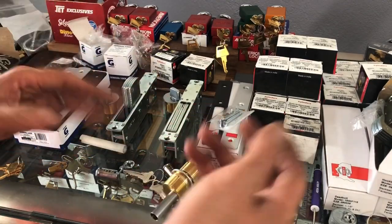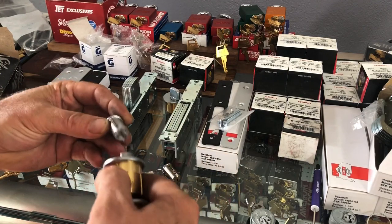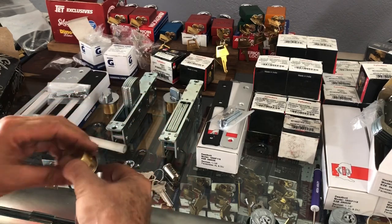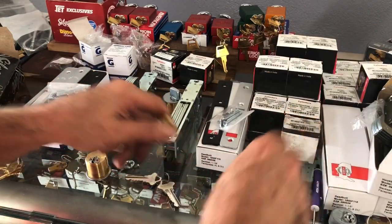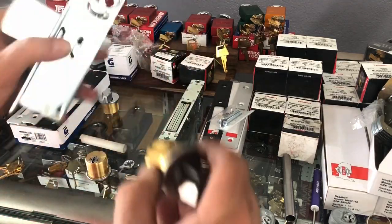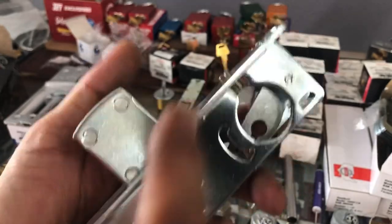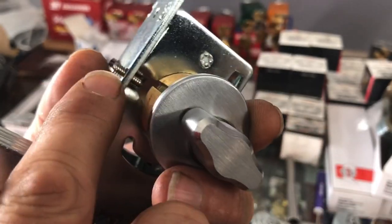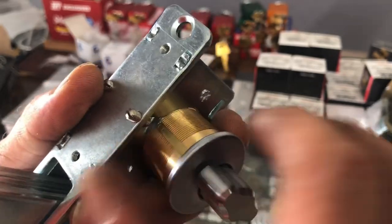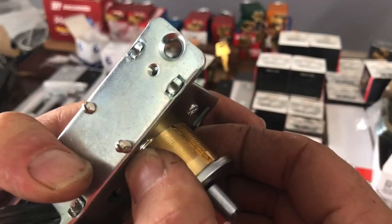If you're using a six-pin key, you'll definitely need to take it apart and rekey it. Now let's look at cylinder collars, because you have to have them to make these work properly on doors — when you screw in a cylinder, there will be a gap. A tip: when you're rekeying a cylinder that's already on a door, just loosen — don't fully remove — the top and bottom screws. Tightening down the collar can bind the cylinder in the door hole.